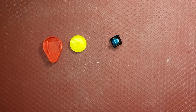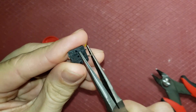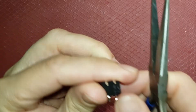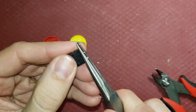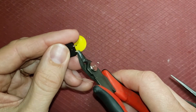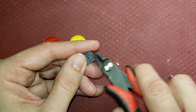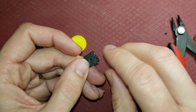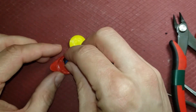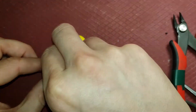First we're going to prepare our switch components. I'm going to use flush cutters. I have these legs and I'm going to straighten out all four of them. Then I'm going to cut off two of the legs as well as these little knobs. When I have those pieces cut, you can just test — this should fit nice and flat and snug right in the base there. Now we'll glue that in in a minute.